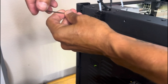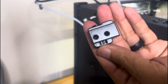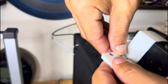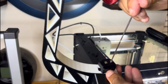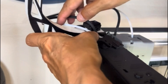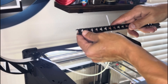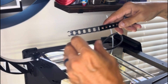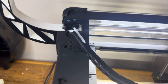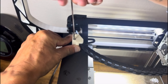Move to the back of the printer — remove the screws holding the filament runout sensor, unplug the harness, remove the cotter pins holding the PTFE tubing, and remove the tubing from the sensor. Next, mount the filament runout sensor on your spool holder, making sure the harness plug lines up with the opening on the rack. Install the supplied nuts into the bottom of the spool rack followed by the required screws, then place the rack around the printhead wire, guide the runout sensor through the hole, and plug it in. Secure the spool rack with the required screws, then remove the clips and factory PTFE tubing. Install the snail chain with the open end facing the spool rack, run both the printhead wire and new PTFE tubing through the chain, and secure with the 3D printed parts.